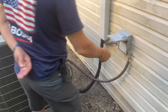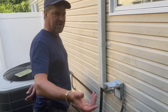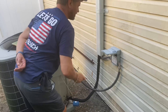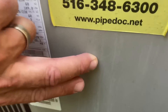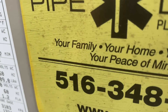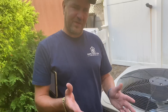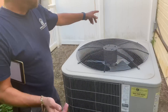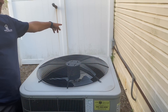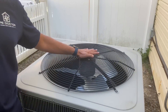I just want to show them the right and proper way to pull a disconnect. Left hand behind your back. Don't wear a pound of gold. I can hear the hum of the contactor when you put your ear against the panel. I already checked the circuit breaker panel - we had all breakers, didn't appear to be tripped. One marked 'hot tub' is in the off position - maybe they have a hot tub, maybe they don't. When you put your hand on top of this condenser fan motor, it's hot as F.